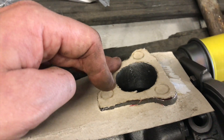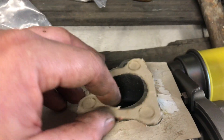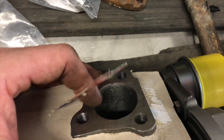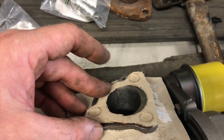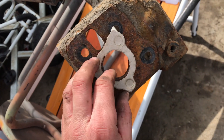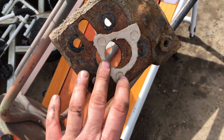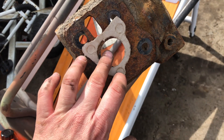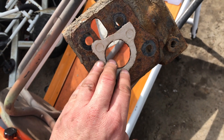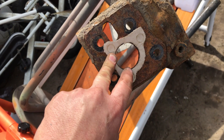There's a template for a flange that I'm going to have to try and fabricate, just done with a lovely piece of DAS. I found a piece of stub axle in the scrappy — it's not cast — and that's going to save me a lot of messing around because it's nearly the same. So I'll cut that round, cut that out, then drill the holes and we've got a flange.